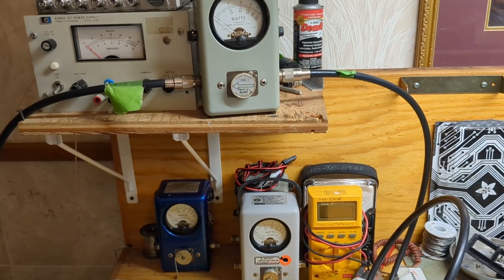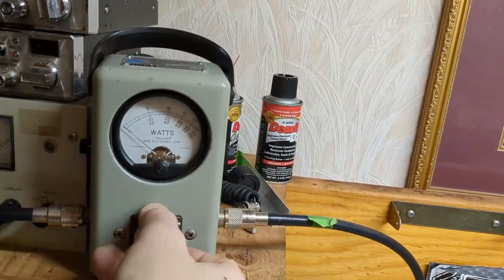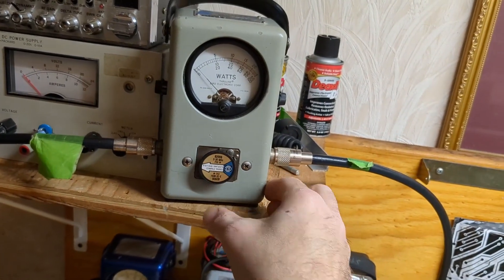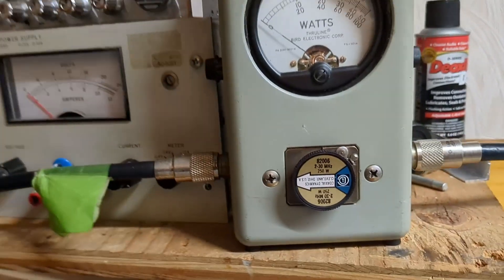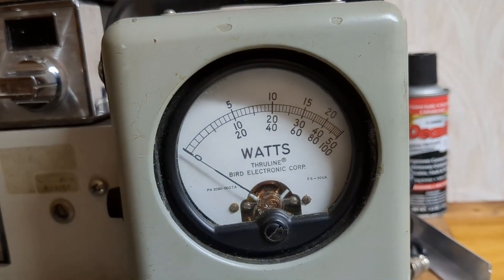On audio — 800 watts! And that's with just 75 watts of drive. Realistically you could use 40 or 50 watts; you're not going to hurt anything. So let's start cutting the drive back. I'm just going to use the variable on the amplifier — it's just a one-pill — so let's cut this variable back to three-quarter. Then let's turn the amp into standby and go back to the 250-watt scale.